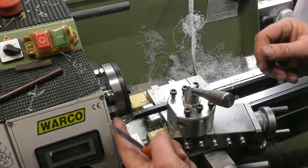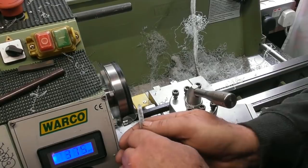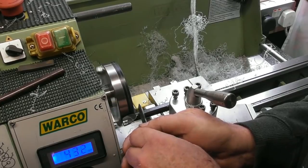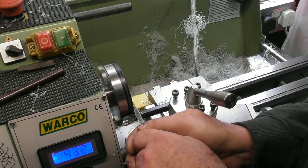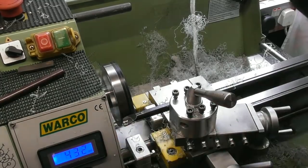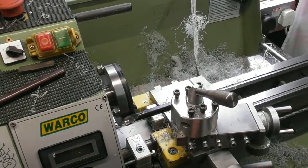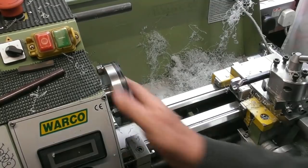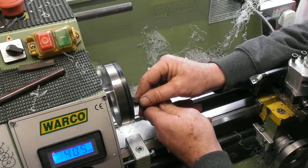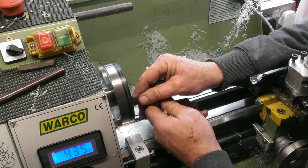I've just flicked the tool round the other way for safety's sake because I'm back here, and now running in forward. I've slowed it down a touch and I'm using my boring bar as a tool rest — I'll find the best edge. We've just put a 45-degree chamfer on the corner by hand. I could do one in that bore as well — being very careful because I've got studs sticking out here.